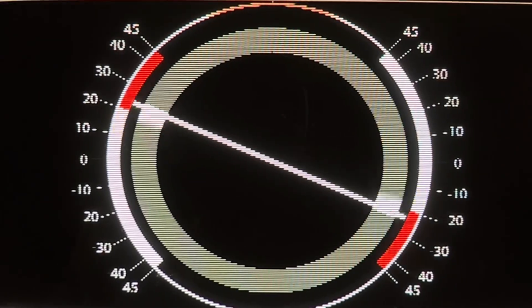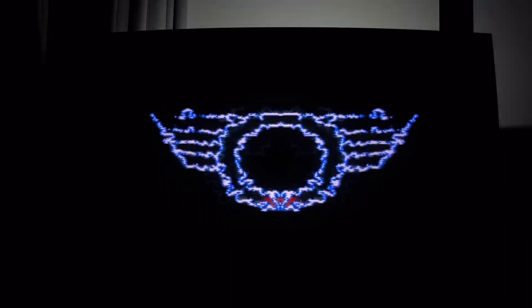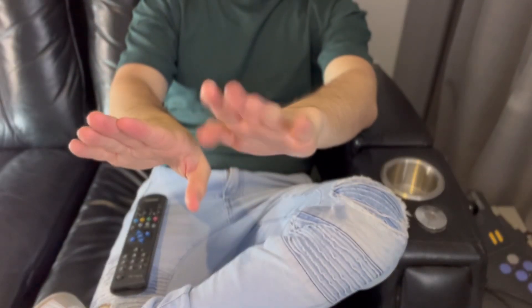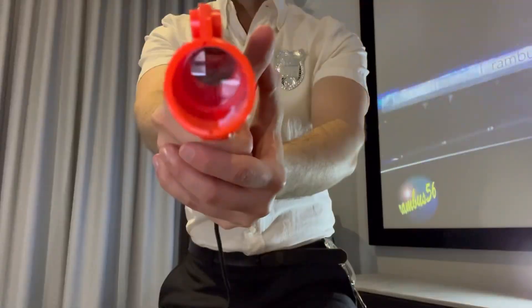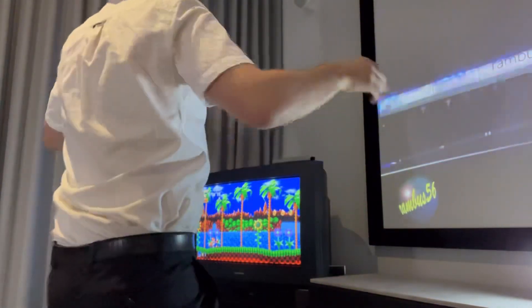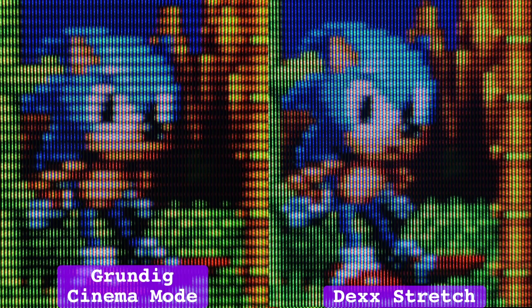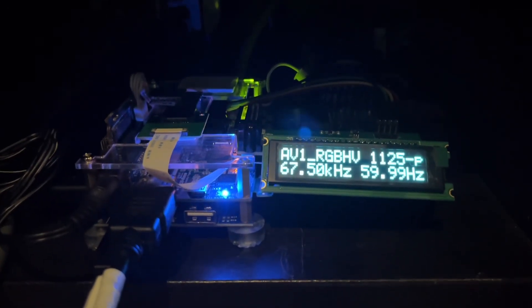The second reason is that aspect-ratio-preserving 240p output — basically 16×9 within a 4×3 window. Take a look at what happens when I first get it displayed on my widescreen CRT. The widescreen CRT has a cinema mode for vertically stretching 4×3 video, and not only does it restore the full 16×9 aspect ratio, it does it with hyper-pronounced scan lines. Compared to the DEX doing the 16×9 stretch, I'd argue that the Grundig cinema mode closes the gap to a low-end pro monitor. It's a lesson that the best downscaler on paper might not be the ideal unit for your setup, so don't forget to consider the outlying details that are unique to your individual setup and needs.